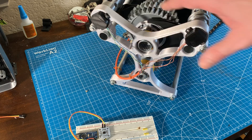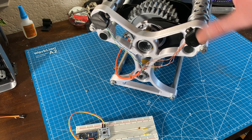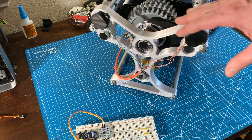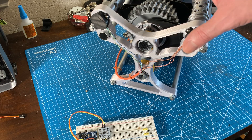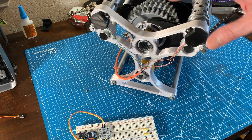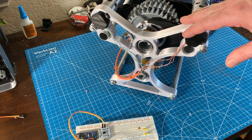I went through the whole calibration process AMS has on their datasheet but it didn't help at all. Then I found a single forum post about the AS5600 that had the answer. Many high-speed I2C devices essentially freeze the low byte value when you read the high byte so it doesn't update out from under you as the sensor state changes. That is not the case with the AS5600 — it was actually changing the low byte value during the read as the shift barrel was rotating.